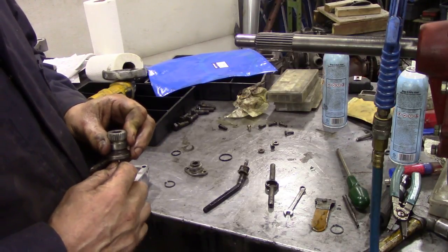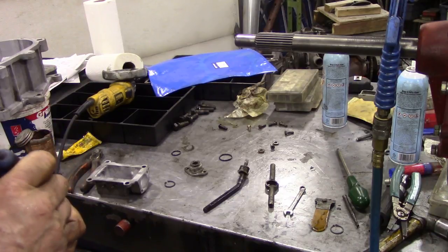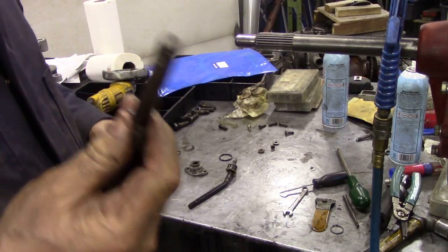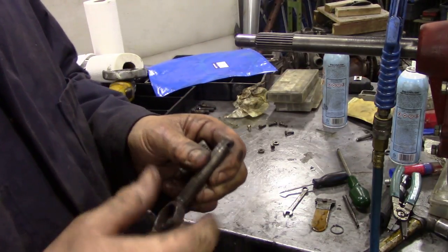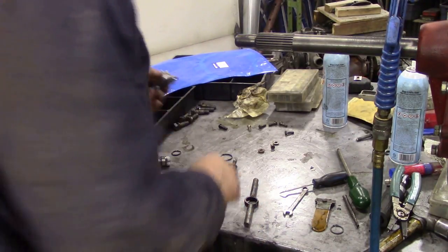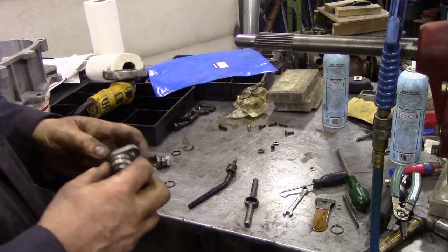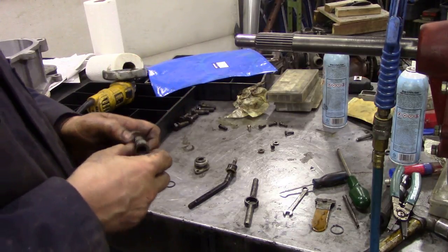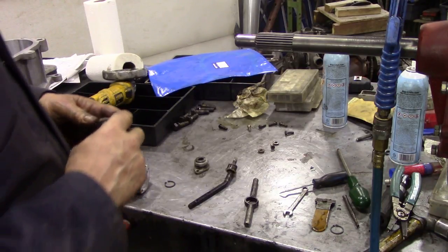Now we get the O-ring to go in - tricky. I got the O-ring in by pushing it back with the original shaft. However, there was a little burr on here so I took that off with a grinder - I should have used a file but too lazy. Next thing, we're going to put a new O-ring on this outer piece, this bushing. There we go, that's one on and then another one on here. I didn't clean this one up too well, but probably nobody will ever use this gearbox. I'll show you how to do it anyway - that's all done.